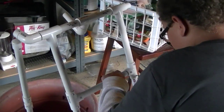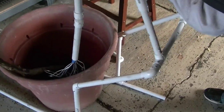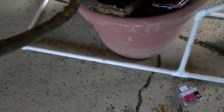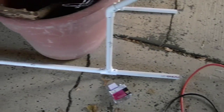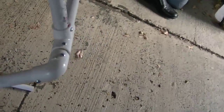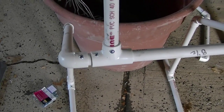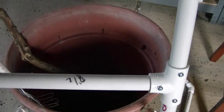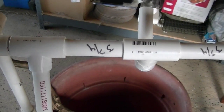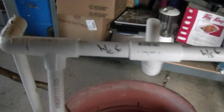Ian's putting the final touches with the screws. Just some quick dimensions on the bottom here going up the legs: we cut those pipes 26 inches long. The ones behind it are 10 and a half inches long, just because it's what we had left over on some pipe. Then we've got 14 and a half inches there, and 14 inches there, connected with a couple of T's and a 90 degree. Then 8 and a half, 8 and a half, and 3 and 3 quarters, 3 and 3 quarters. A couple more T's, a couple more 90's.